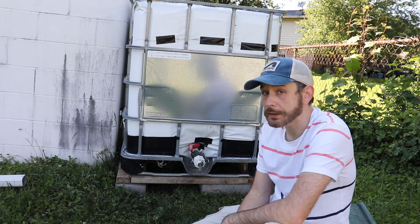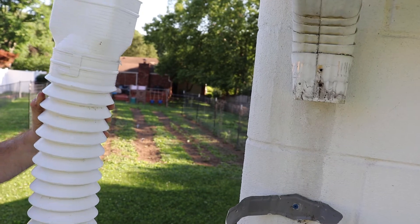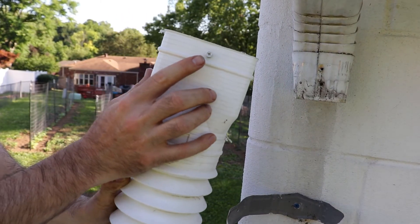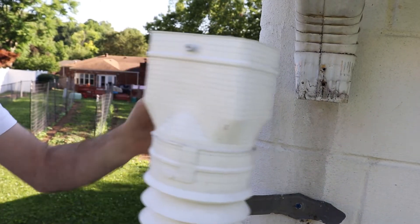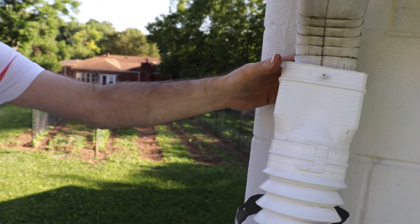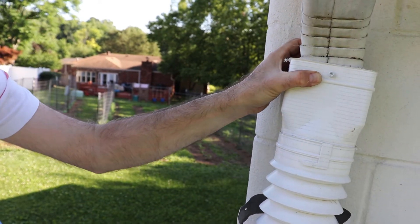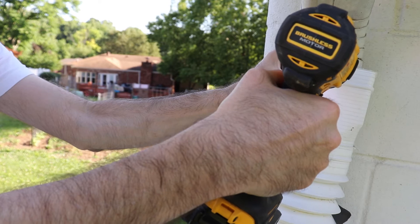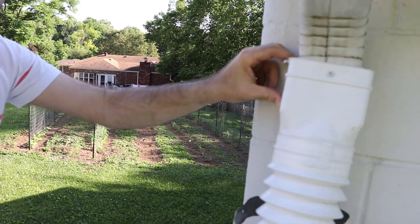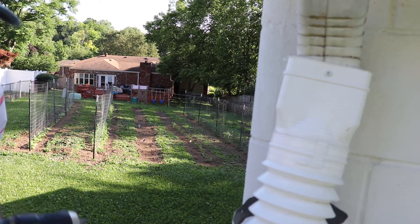Next I need to put my spout and lead it to the top so water can start collecting. This is my downspout and this is that plastic spout I showed you earlier. I drilled a hole right here and just put a gutter screw — that's what it's called. I'm going to attach it to this right here. Actually there's one above it that I like a little better, and screw it on in. It's a little shaky so I think I might put a couple more screws on this side and that side. I'll show you the finished product when I'm done.